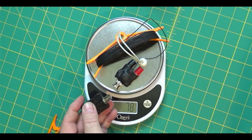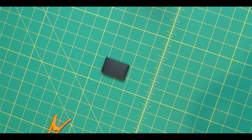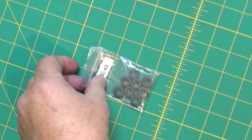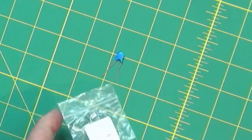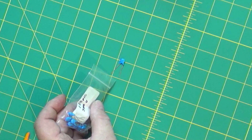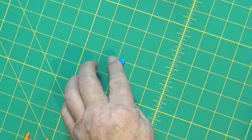The one we're going to make today I'm going to put on the opposite style. It's like an inch and a quarter of heat shrink that goes over the top later. We're going to use a 50, which means they're about a half inch, and 43 is the mix. What I didn't mention also was the capacitor — I am going to put the capacitor in because it's pretty easy to do on this build. This is a 100 picofarad, 3000 volt — it's more than enough. I just used that one because I had them.